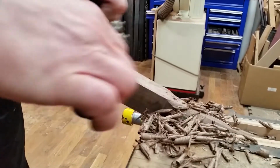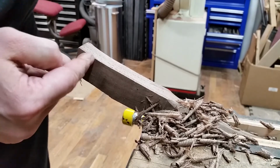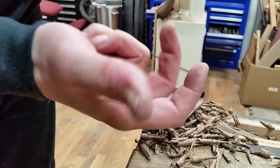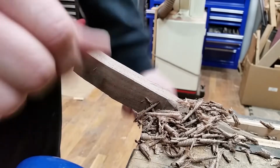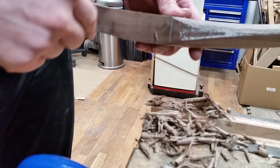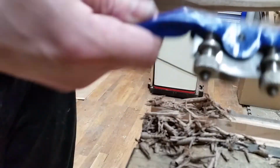You see how it's kind of fighting me that way? So it really wants to be cut in this direction. It may change from end to end, from side to side too. So we're working that profile down. It's okay to do a little bit thinner work down here, right? Remember our grip strength is in our pinky. Think about Nikyo, but that is off a smaller radius than up here. So it's okay to have this taper down a little bit. Now we're going to work it down from this side as well, so don't go overboard. And we don't want to interrupt this flow for aesthetic reasons, this flow right here, right? Having too much of an extra scallop there could be a little weird in how that functions, all right? So this side's pretty well done. I may come back and take a little bit more right at the end there, but I'm going to work this side here. So I'm going to switch from my curved one to my flat.